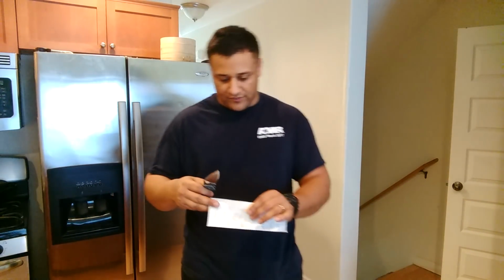What else do I want to talk about? Oh, you know what? I also sharpened it on these ceramic water stones, like your Choseras and stuff like that. Yeah, it'll sharpen it, but not very well. I find that it feels like there's a lot of burnishing on there, so it doesn't seem like it's actually cutting the material as much as it's just burnishing. Burnishing just means moving the metal, polishing it. It doesn't seem like it's actually cutting it though. We'll have to do a side-by-side maybe in the future, but I just played around with it some more this weekend. I've got a nice edge on there.